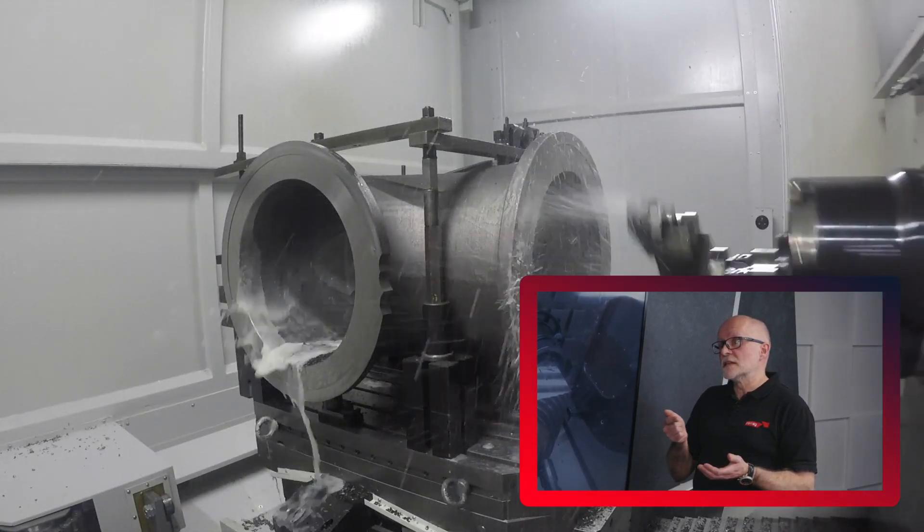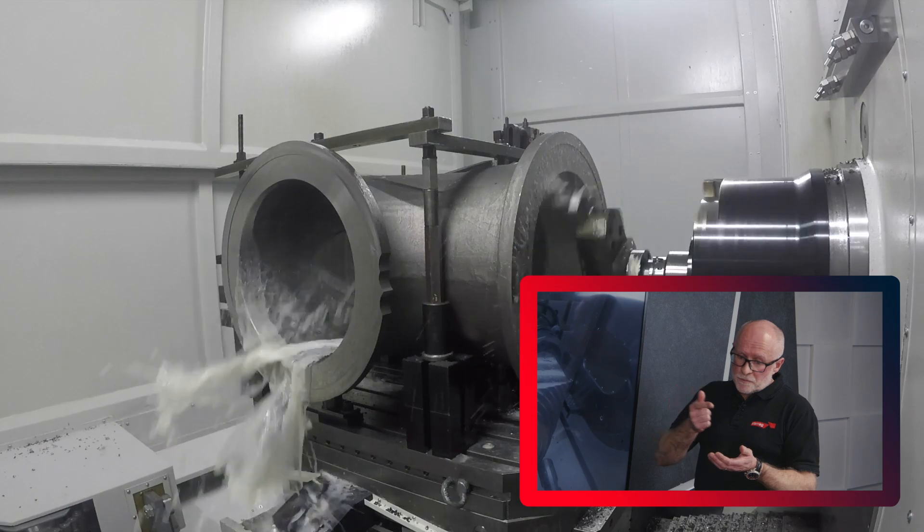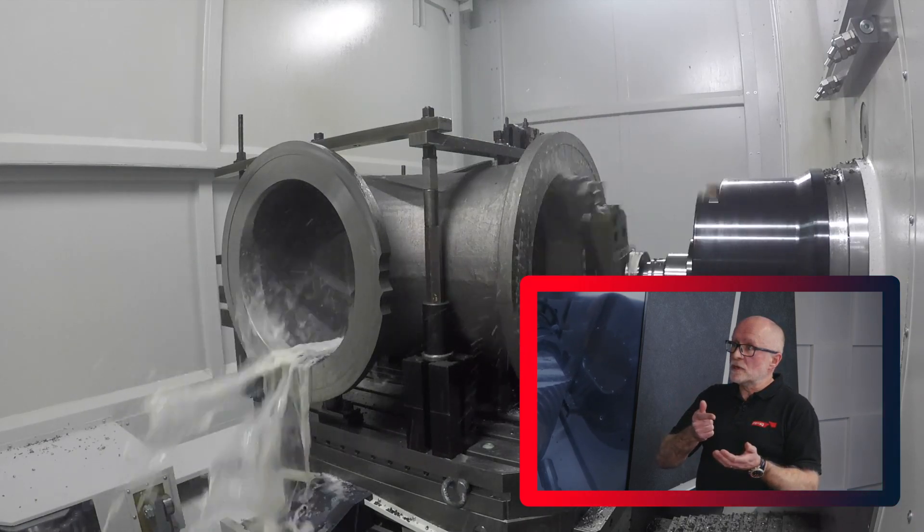There are two elements to this. There's the parent metal, and in some cases there's actually an Inconel or stainless steel clad material that's welded on the surfaces and then needs to be machined. So there are different materials to cut on the same machine in the same kind of way. Traditionally you'd use multiple tools — lots of tools to produce different diameter drilled holes, different diameter bored holes, chamfers, and everything else. We have what we call the DBF head, where we have a u-axis in the head, allowing us to place a tool inside the bore and produce multiple diameters and facets in a single pass.